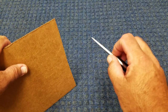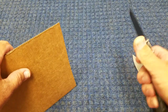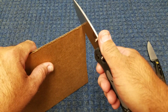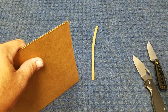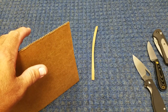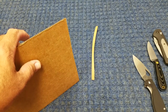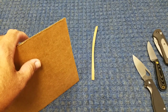That's where the super easy cutting comes from despite thicker blade stock. Compare that to the Freak, which is 23 thousandths behind the edge with 0.112 blade stock - not very thick stock, but thicker behind the edge - and it still cuts okay, but requires more force for the same cut. This is also because I watched a video where it was assumed that because a knife had thin blade stock it was going to be an excellent slicer, even though it was an unboxing and nothing had been measured. That assumption really bothers me.